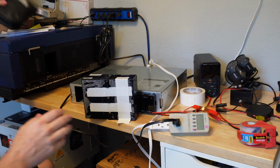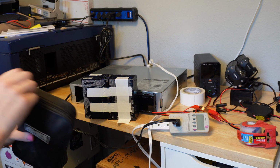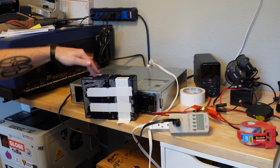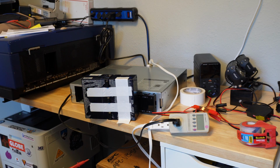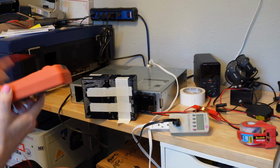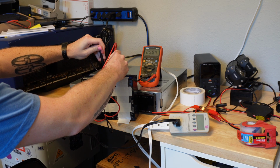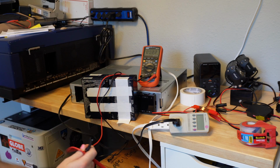And when I first bought this, it failed the battery self-check, and I was like, well, that sucks. Probably just needs new batteries, whatever, not a big surprise. And they're not very expensive either. It's like nice name brand replacements for these, $70 maybe. But I got them out of the UPS and poked around in there, and I got 12 volts. And I thought, well, that looks pretty good. I mean, what's it unhappy about?